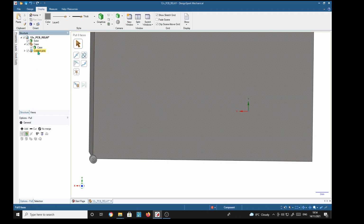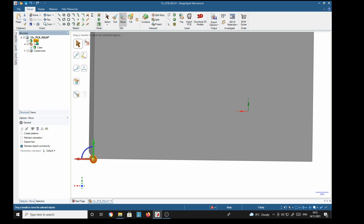We'll place it in position, select it. It's the solid one. Tell you what, we'll change the name. Solenoid pin. Now this is, according to my drawing, 11.92 from the left, and 6.44 from the bottom. And we need another one. Holding the control key down, we drag away, we get another one, and it's 10.16. And that's all our pins.